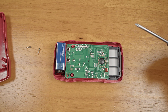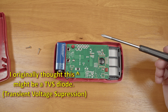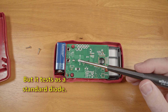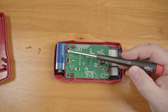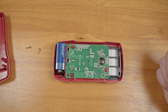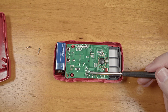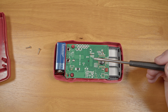Finally, I just wanted to show that meters with questionable ratings don't only come from the internet. I picked up this supposedly 600 volt CAT3 rated meter at a local hardware store. There's no voltage surge suppression and pretty poor isolation of the input circuitry in general. The 9-volt battery that powers this meter has a metal shell, and the plastic for the battery compartment doesn't overlap when the case is installed — so essentially you have a metal battery shell just that far away from the two input terminals that could have 600 volts on them, plus up to 6,000 volt transient spikes. It's also pretty funny that an entire section of the board is unpopulated — tons of spots for resistors, capacitors, some type of integrated circuit, another large capacitor, and just nothing there.